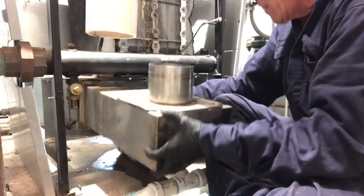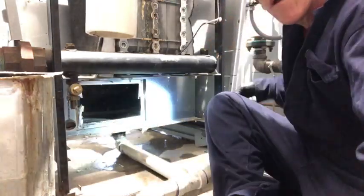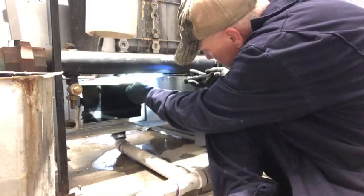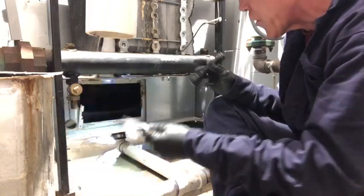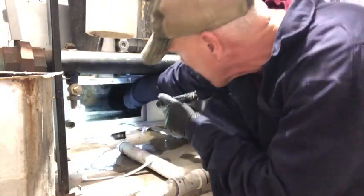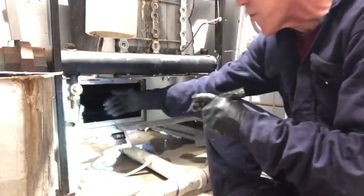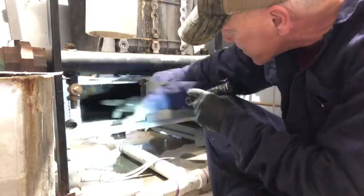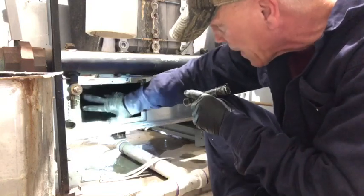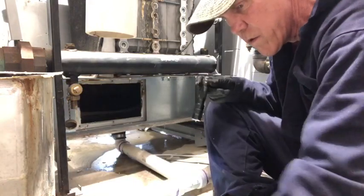And there we go. As you can see, look at this gasket, how bad it is. It's completely disintegrated. And this is why if you come off on most of these Modulex boilers, they're leaking. If you see you got this plate here and that plate over there, those gaskets are in the same way, but there's not as much going on through there because all the flue gases are coming through this area here. So they're prone to leak. Like I said, along with that, people step on them. You'll see where it's this right here, it's been blowing out gases for a while because it's rusted out right there. So no big deal, it's all part of the maintenance.